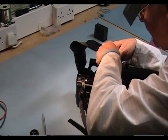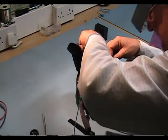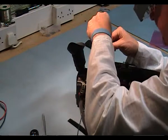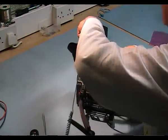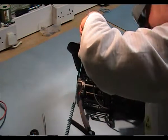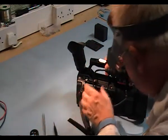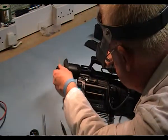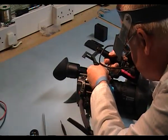You must remember before you take out the last screw to hold the handle so it doesn't fall away from the main camera assembly. Otherwise there's a cable inside there that may get damaged. Now carefully lift up the camera and remove the handle. You can see a connector underneath — just clip it out.